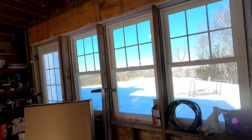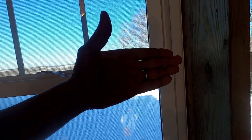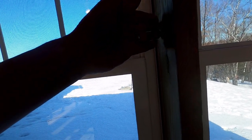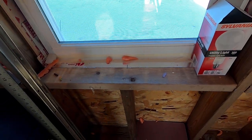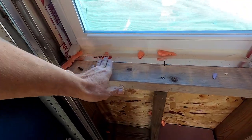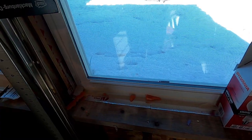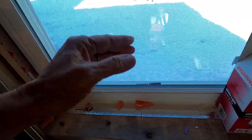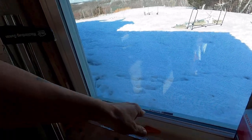And then, on the windows, these new construction windows have a flange on the outside and they're connected right to the stud. So they don't put any weight at all on this sill, meaning the sill doesn't have to be anything special — it doesn't have to be all built up. This sill is on a five-degree angle from here out so that any water or condensation will drain out the bottom.